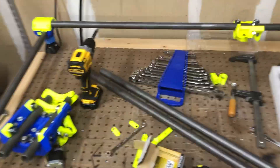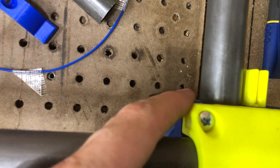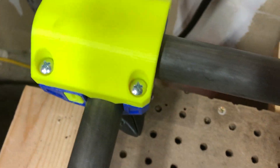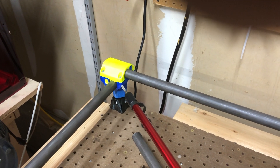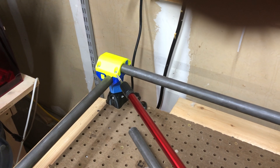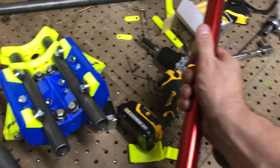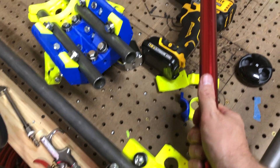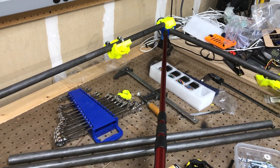I use the very same pole to create a diagonal length between this flat edge right here — where the blue and yellow touch in the middle of the extendable staff — and go all the way to the corner to that same flat edge. I'll demonstrate: I've got my pole, I put this end right there in the center, come over here, and I'm just going to barely brush that. I'm snagging it just barely — if I put any force at all it goes right past. Then I do the same thing on the other diagonal, setting it up so it is just touching and moving it back and forth, just barely snagging.